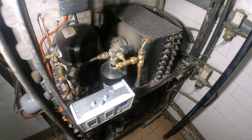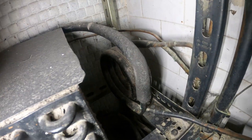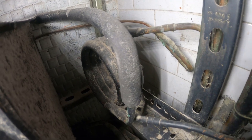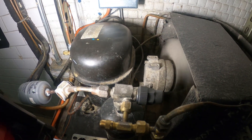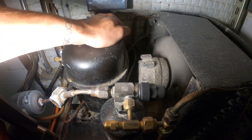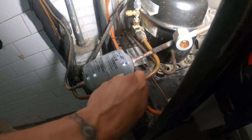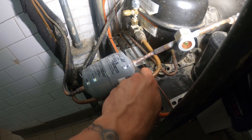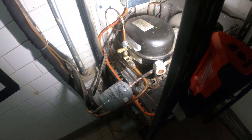All right, so that was the middle refrigerator. As you can see the fan motor started. Seems to be a custom conversion — that's the water-cool condenser. Compressor started. Suction line is somewhat cool.